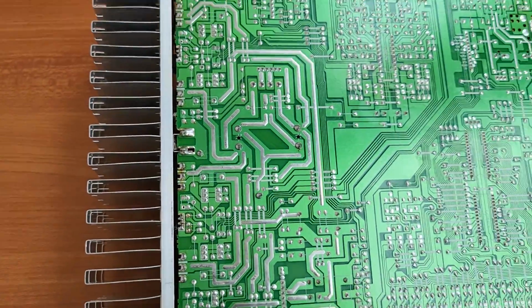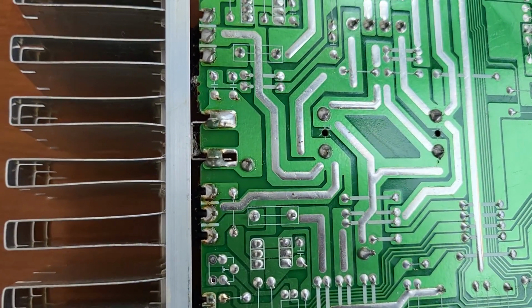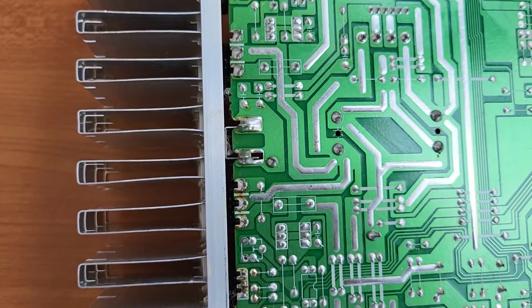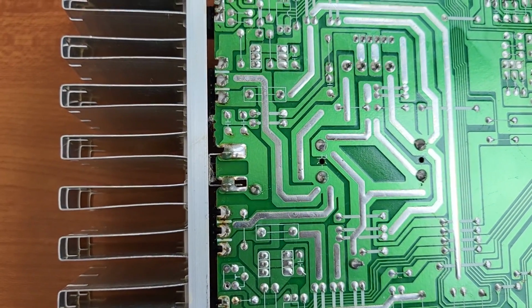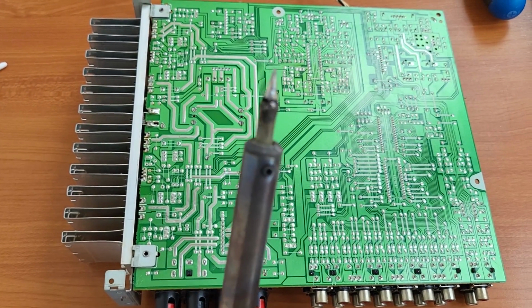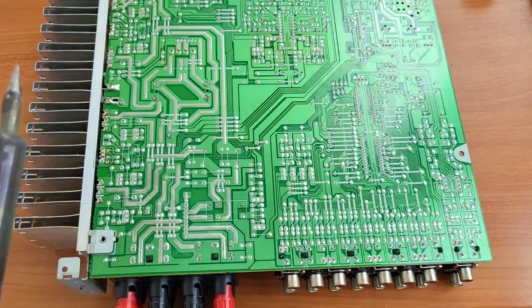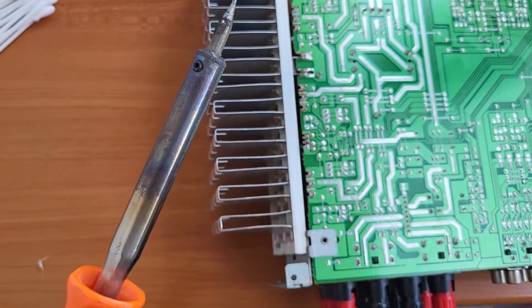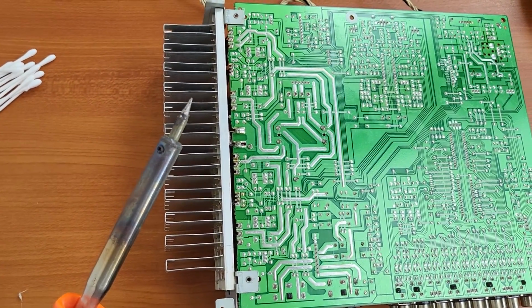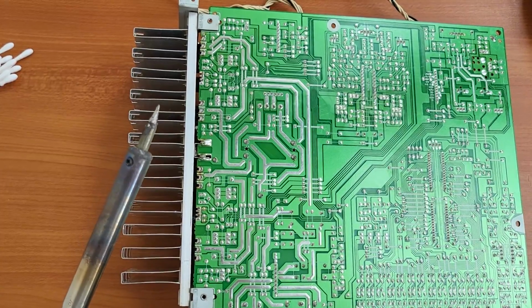Okay, so I will need to get out my soldering iron, and I will get the big one this time. We will not use the station for this because we need a lot of heat here, and it's better to use a more powerful solder gun. It's not a gun, but yeah. So this is it. It's a 60 watt with a really thick tip, and I'm going to heat up and pull away the whole heatsink all together. I will not be able to record it because I have nothing to put the phone on here at home, so we will see after I take it down.